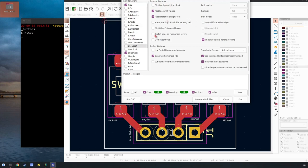We have Front Copper, Edge Cuts, and a directory. Use the drill place file origin — if you forget to click this, you'll have to fix it in the next program. Otherwise it'll use the zero-zero of the page. Everything else looks good, so let's plot.